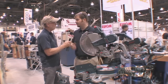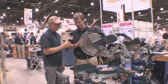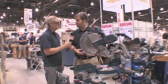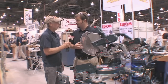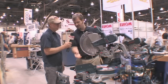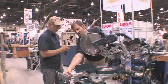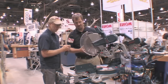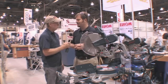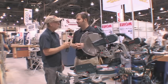And this is unique to Bosch. Yes, completely unique — this is a Bosch invention that we just recently brought out. A couple of features: it cross cuts up to 14 inches nominal, so we've got more cross cut capacity. You can cut up to 6.5 inches against the fence as well. There are built-in material supports on each side, which makes life simpler for controlling material as you work. Quick sliding fences. All around, it's a powerful tool at 15 amps and 3,800 RPM — a real precision tool that can also travel and survive job sites.